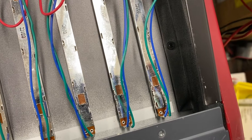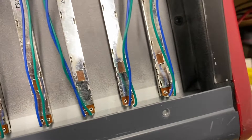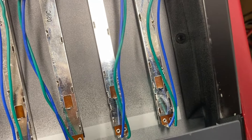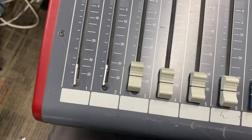On the other side we can see the fader was recessed a little bit and there's some looseness going on. This one I think is just the screw and may not need to be replaced, but I'm going to do it anyway since I have the parts. This one you can definitely see the housing is separated and there's potentially some damage to the resistive trace under there — maybe, maybe not — but we're going to do this quickly anyway.